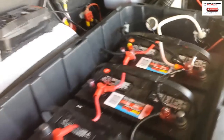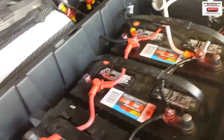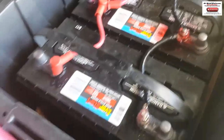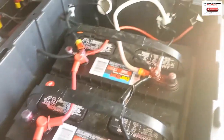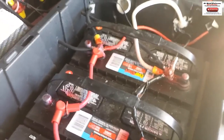This is my battery bank — I picked up this holder at Kmart for eight bucks. I dropped a couple little pieces of wood here and there for shims and the batteries fit snugly. I use 12-volt rather than 6-volt, and the reasoning is that if I'm out in the woods and my pickup batteries go dead, it takes two of these to start my truck. So I could pull two of these out and still have enough amperage to fold up the unit and get out of the woods.